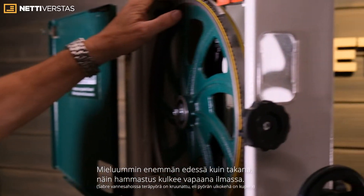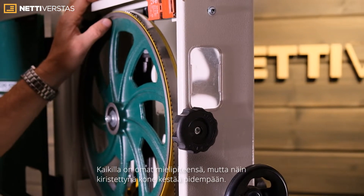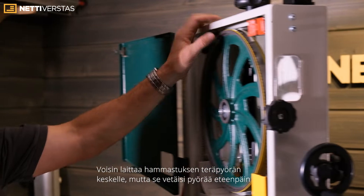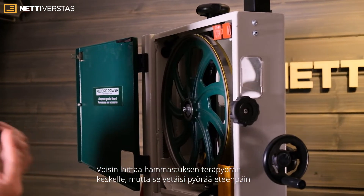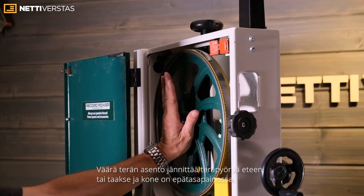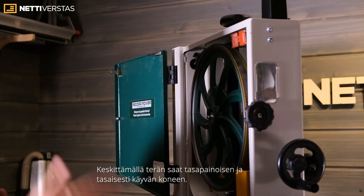Position it slightly forward to allow the set to be on that third crown grind at the front. There are different opinions, but what I'm trying to tell you is to look after the machine. If I put the center of the gullet in the center of the wheel, I'm straining the top of the wheel — it will be out that much — because when you track it, it brings the wheel out or back in, making it an unbalanced machine.